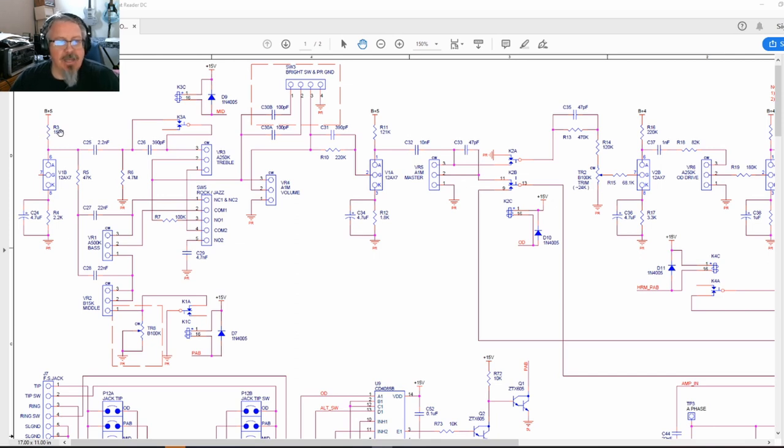I am making some changes — the 183 uses what's called the skyliner or high plate, so values like 220k and 3.3k are used in places. The tone stack values are also quite different — I'll talk about those during the actual build. The general topology is identical: a triode for the clean channel that comes in, goes through a tone stack, and then the preamp boost switcher allows you to basically bypass the tone stack completely, giving you a lot more gain and a lot less cut from that section.